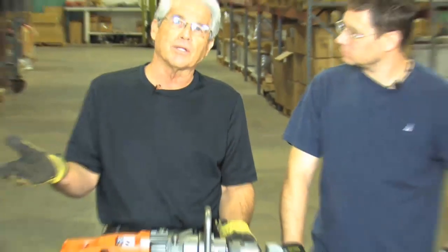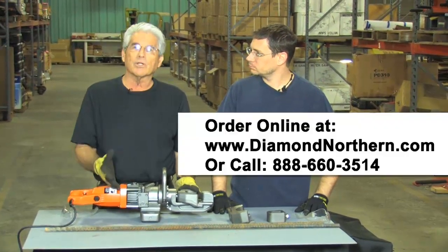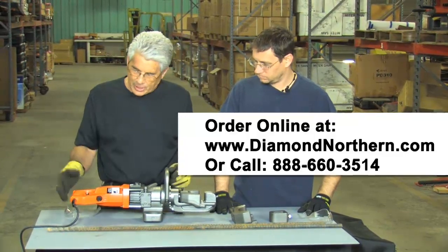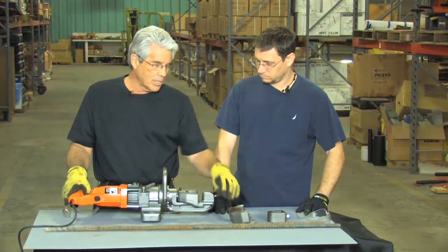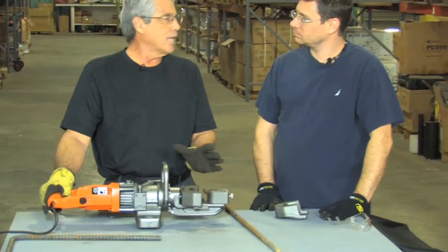And so we came up with this product. It's an electric hydraulic tool, an electric motor that runs off of your standard 115 volts, 10 amps. So you can run it off of a generator or standard power. This unit is designed so that a piston moves forward, and you set the rebar across, and you can bend the bar. We had a number of our customers ask us about making this tool to where it would just bend 90 degrees, so that they could have a worker on the job site not have to even look at it.